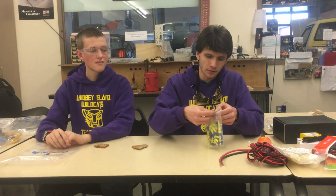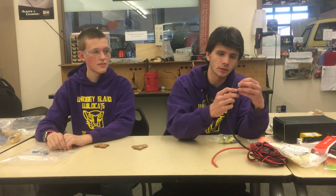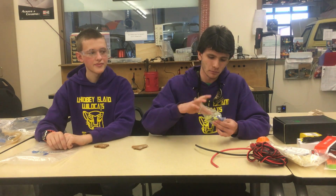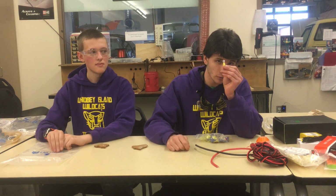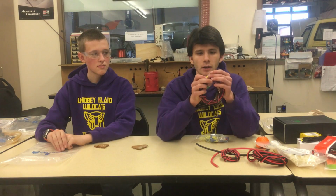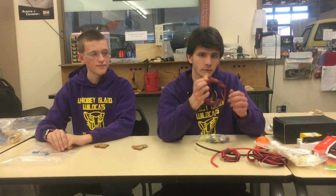So these guys, what you do is, these are essentially metal connectors. What you do, just take one end, put it on a wire, you crimp it down, and then that allows you to put on connections to your motor controllers. So this is probably one of the most common looking ones you'll see. It'll go on the wire of whatever gauge it's set for. It'll tell you it's based off of color. You crimp it down so that it's smashed down on there, and then you can put this onto the motor controllers that you have.